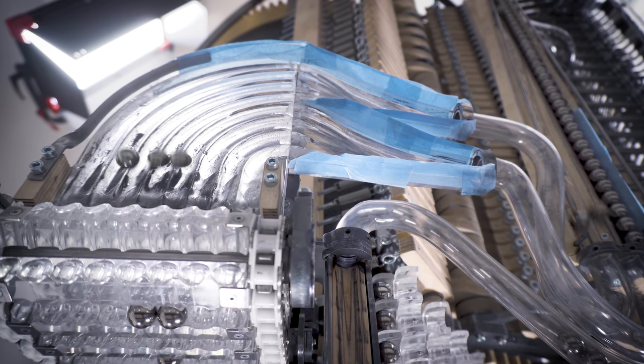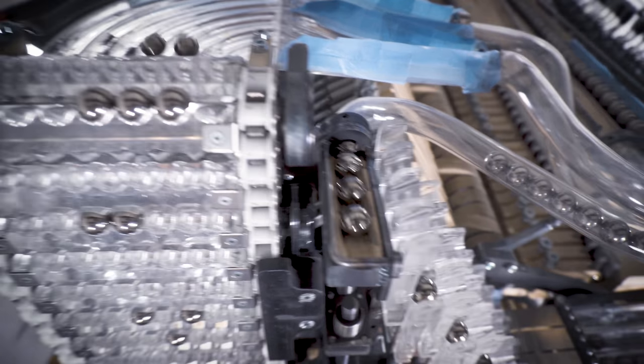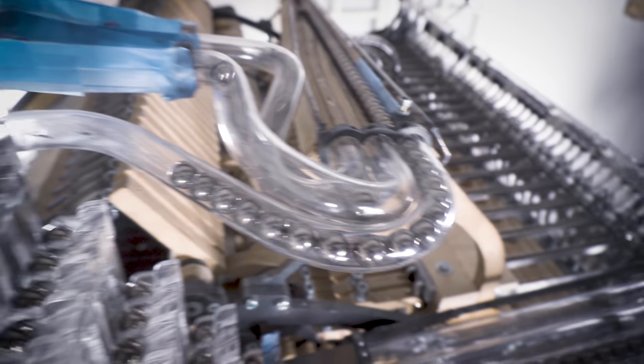So here is what happened. The marble divider turned slow and the marbles started to build up inside this pipe here. This pipe should always be empty, they should never stay in there. So the fish there kept on feeding marbles faster than the marble divider could clear them. This pipe got filled up, so the fish there couldn't drop off the marbles because other marbles were in the way. So 6 marbles ended up on the floor just before the test was done.